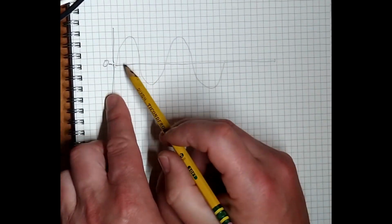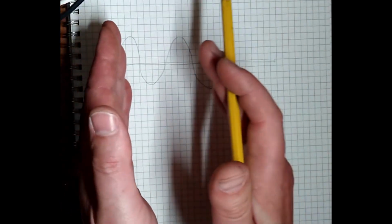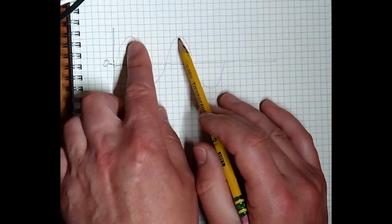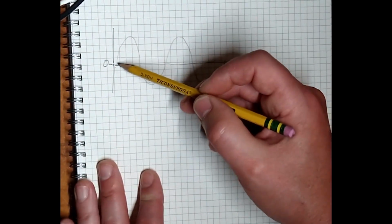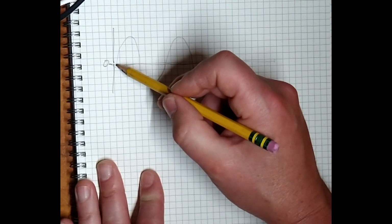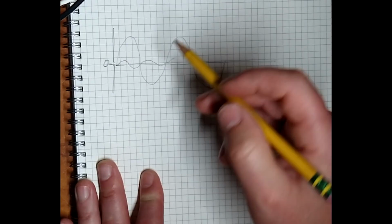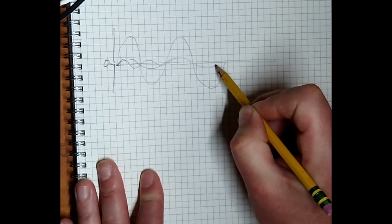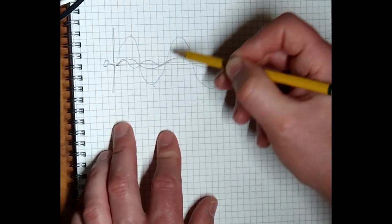All right. Now, the frequency is how high the note is. So if these waves are closer together, that's a higher frequency, a higher note. And conversely, if these waves peak to peak are further apart, that's a lower note. But what we're concerned with here is the amplitude, and that's the gain on this. So this could be the same like this, low gain, quiet, like that. I screwed that up, should be like this. Okay, that would be quiet, low gain, low voltage, or the same frequency really loud as this one that I originally drew.